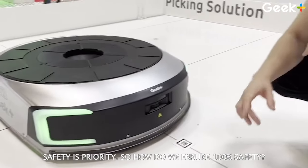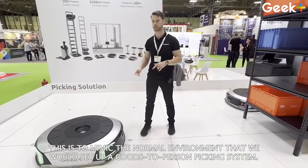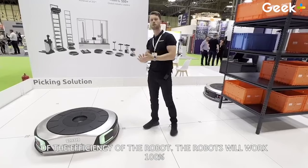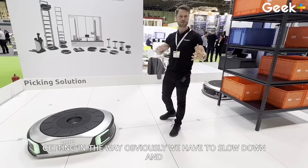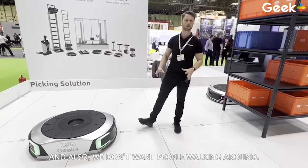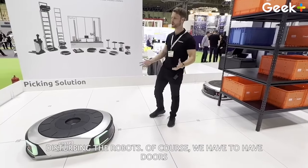So how do we ensure 100% safety? We separate the people from the robots. If you look at this grid around me that we have set up here, this mimics the normal environment we would set up for a goods-to-person system. You don't want the people and the robots together — safety is one big factor. But also, people get in the way of the efficiencies of the robot. The robots will work 100% to their efficiency and operate as intended without people getting in the way. We want the robots to do their job as instructed and get the most out of the system, so we keep people out. We want people standing, being very useful and productive in one place, and we let the robots do the legwork. So we fence off the area and make sure nobody can accidentally disturb the robots.